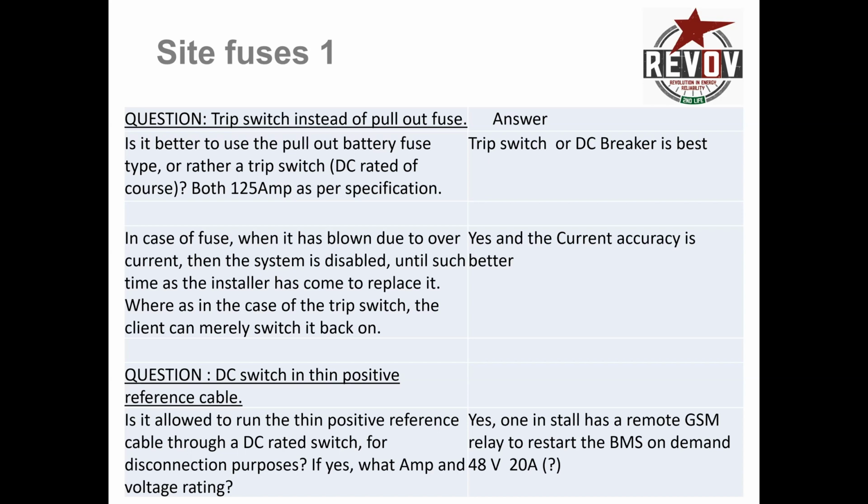The reason being is that the BMS will trip at 160 amps, but you don't want to rely on the BMS because that's effectively a 4,000 or 5,000 Rand fuse, when you can actually put in a 200-300 Rand fuse and get a much better performance. So always have that fuse in it. That also meets DC circuit codes and that sort of stuff. Those codes come from, well, they're actually international. So yeah, you can look it up as well.